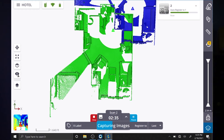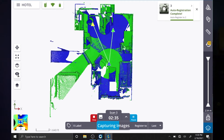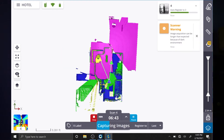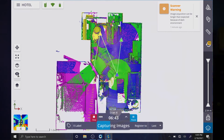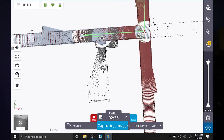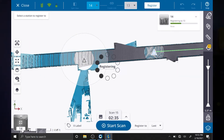This commonality between pieces is called overlap, and generally the more overlap you have between stations, the better the pieces can be put together. You're looking for overlap that has features that easily match up. Cylinders or flat planes are easy for the software to see and match up, but if you have a lot of flat planes such as walls, it's good to have some of them at right angles to one another. Long flat walls without any other identifying features can be tough to link together with any degree of certainty.